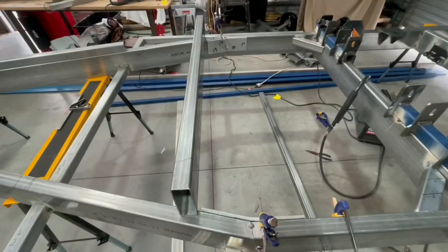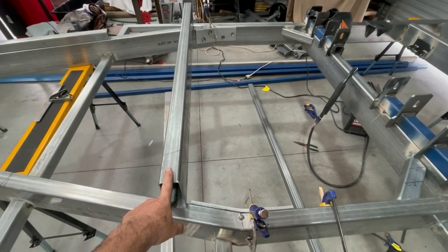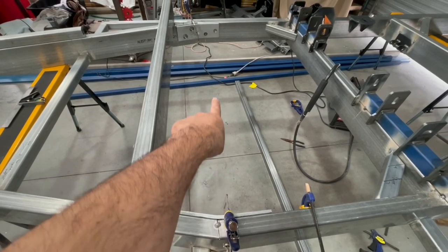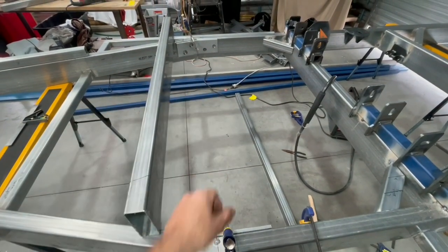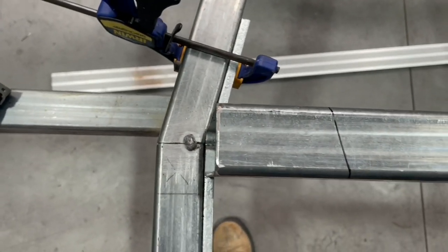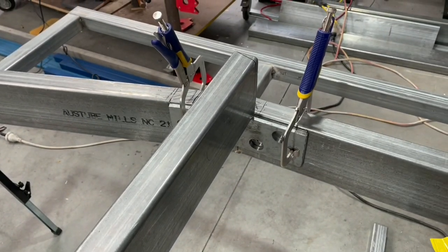I've got to put in a cross member at the front near the A-frame join. I was going to move that further forward, but I don't think from a structural strength integrity perspective it's a good idea. It was to accommodate the tank. Moving these gussets achieves the same outcome for me. I've got 610mm for a 600mm wide tank to slot in nicely there, so not much room for error, but should be right.